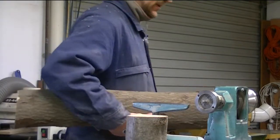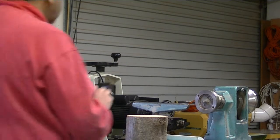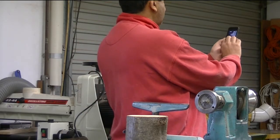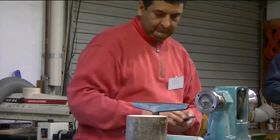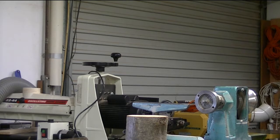I thought I'd just quickly talk about the cutting process. Obviously, when you want to cut something like this, you're going to need a jig so that it doesn't try to roll the log over onto your fingers or bind the blade. Because we're aiming for a hemispheric cut, the length you want is about the radius, the smallest radius of the log, plus a centimetre or two, proportionately.